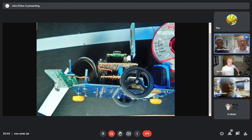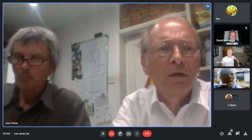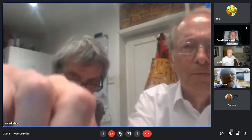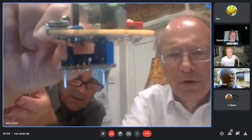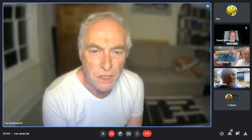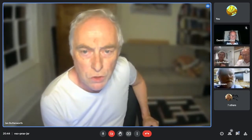We can put it in front of the camera if you like. I'll just see if I can do that. Let's have a look. Can we see that? Oops. There's the camera. Yeah. So you're passing those signals straight up through that regulator board and then up to the Pico board on top. That's correct. There's one instance where we've got 5 volts coming in, where we've actually got resistors. I'll take the Pico off.